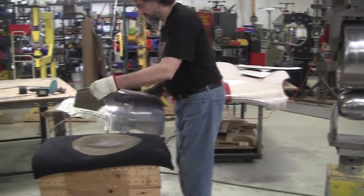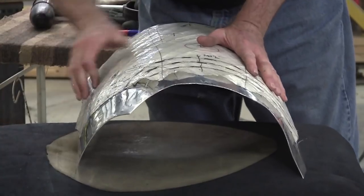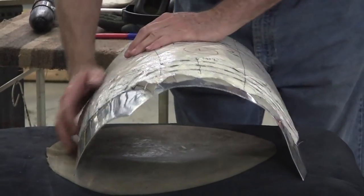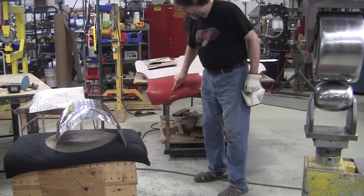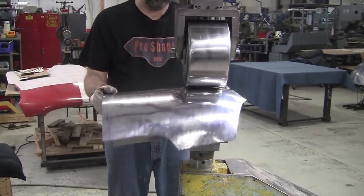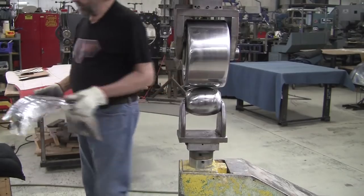Let's double-check the pattern. The beauty of this is it reads whatever you've got in any arrangement you have. I've got this curl arrangement, which is favorable to work the panel. I still have a little low right there — I'm going to chase that. Everything else is looking really nice and tight. You have to pull it really tight to get the assessment. I'll pump up the pressure a little bit, and then loosen the pressure and check again to see if we made progress.